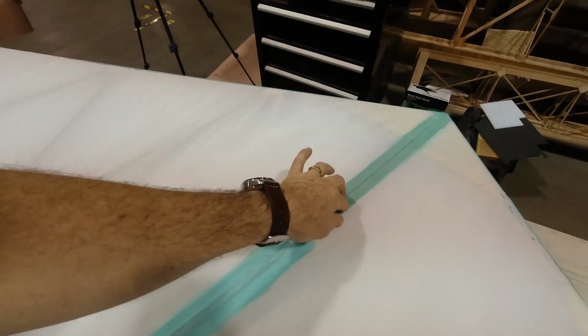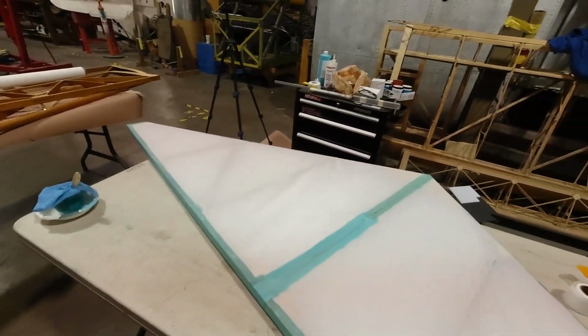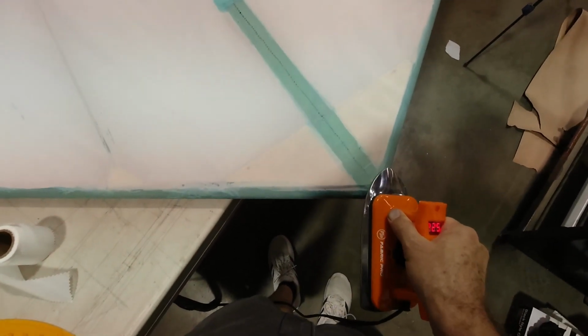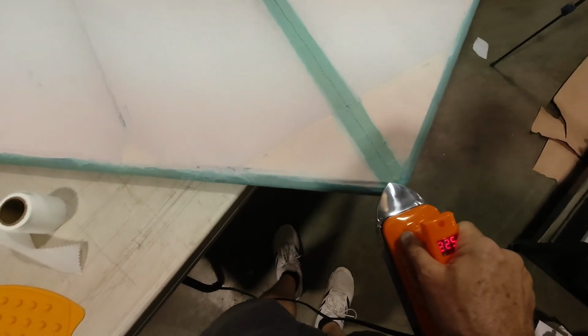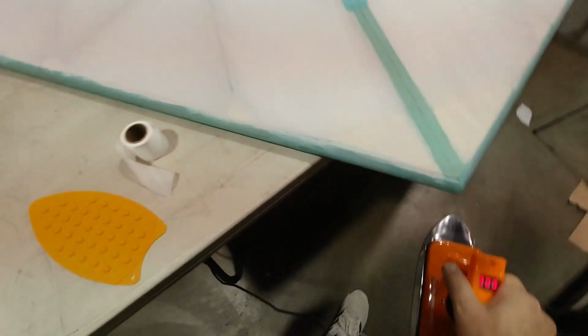I believe up here I have plenty of capture area, so it wasn't really necessary to put the 2-inch tape all the way. So I just stopped right there because I had that much area attached. So no concern there. Next thing will be to shrink this. I'll start with the bottom, of course. And then once I get that, I can go ahead and keep moving forward with what I've got here. All right, the stab gets a 3-inch finishing tape: leading edge, all tips, trailing edge, center section, and then that'll be it for that. And let's see, what else was I going to do?